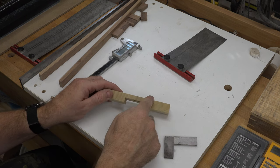Well, one thing you may notice while marking out the rear springs is that it does not give a dimension of the top end of this taper right here. While we know the bottom is 7/16 of an inch across, how high up along the 1 1/4 inch side does the taper go? You can always measure it from this side of the drawing, guys, and that measurement is 3/8 of an inch.